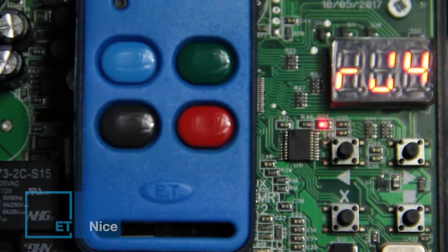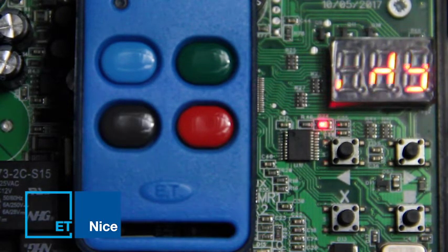This feature is useful at times when the gate must be kept open for extended periods of time. When cutting the lawn on the pavement, for instance, with auto close override party mode active, any trigger on any input will simply result in the control card beeping to indicate the gate is being kept open intentionally.